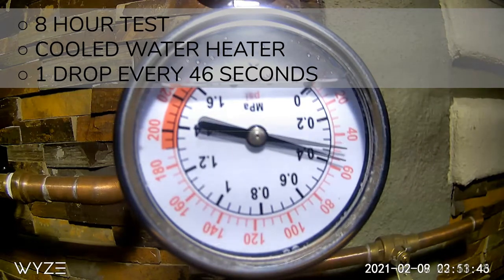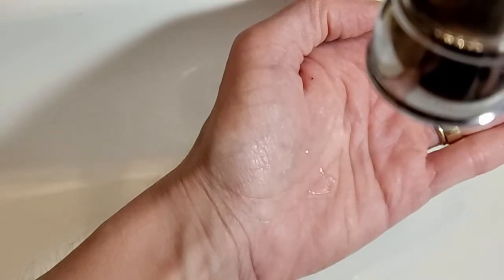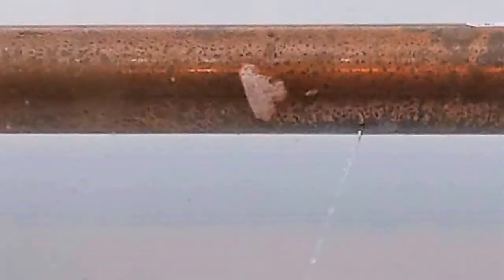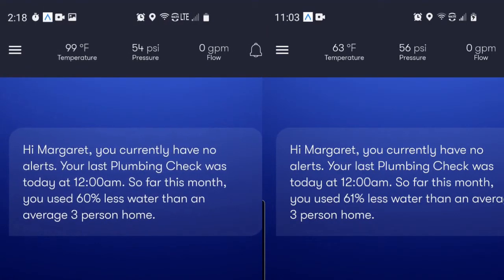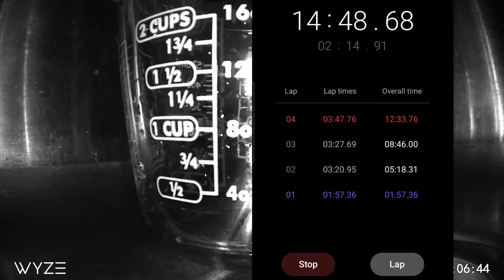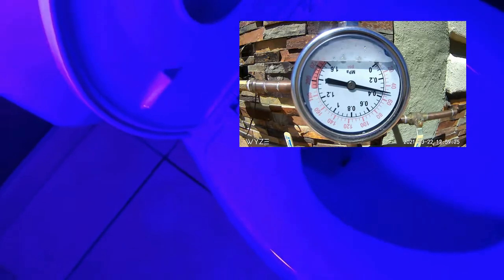We're talking about some small amounts here, but let's take a step back and think about it at a high level. If you suspect a leak and can't find it — you've checked your faucets, ran food coloring in your toilet, and looked behind appliances — it's going to be in a wall or below your foundation. With plumbing under constant pressure from your water authority, a pinhole leak is probably the smallest leak you'll encounter. You'll be losing water a lot faster than these experiments with a pinhole leak, and water pressure gauge tests will catch it quickly, even with a water heater running. There are more variables than what I already mentioned: temperature changes outside, working systems introducing hot or cold water, a faucet that seems to slow down a drip, and accidental usage.